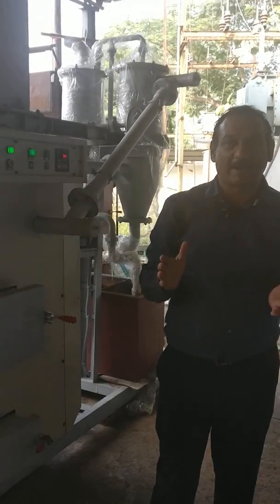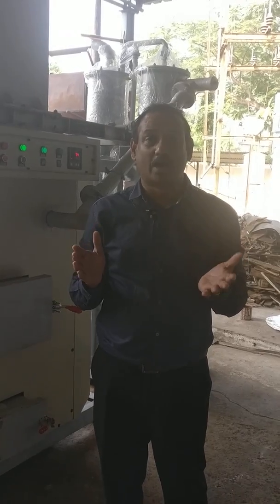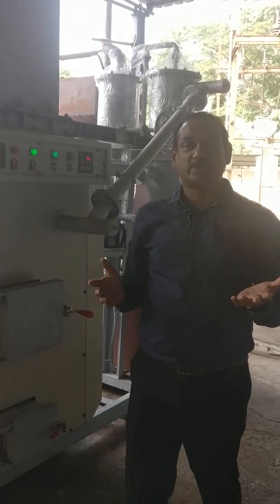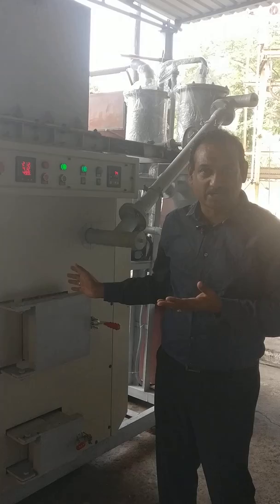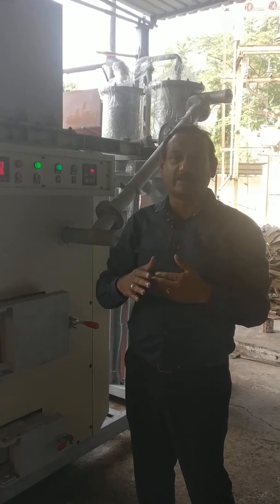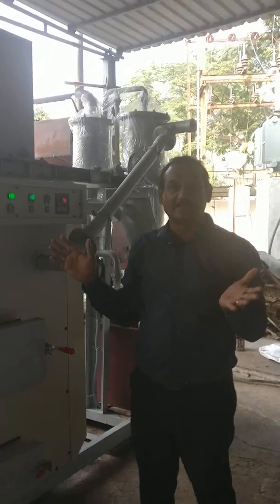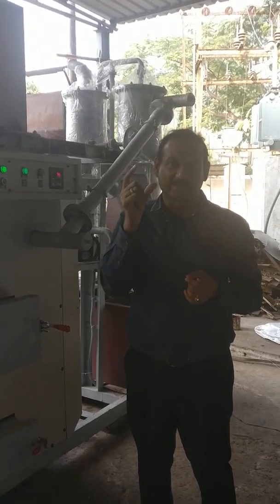When you look at the compacting, 1 ton can be converted into as low as 3 to 4 kg — what we call super compacting. The process uses plasmic technology; there is no fire in it, and the reaction time varies from 4 to 8 hours per batch. The machine you're seeing can process around 500 kg of waste, which gets converted to close to 1 or 1.5 kg of ash.